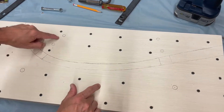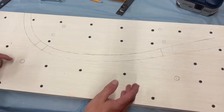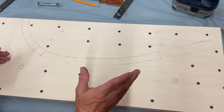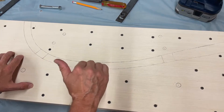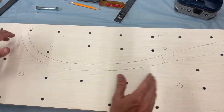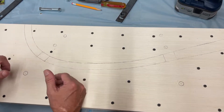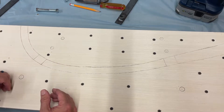I've got the circles marked for the hardware and extended the lines for the curves. Next we're going to cut this out on the band saw. I'm not going to cut right to the line — I'll give myself room because on the bottom part of the form this needs to be a perfect 90-degree angle between the top and the side so the limb lays flat. I've got some ideas from the guys at Trad Gang on how to ensure a perfect 90.